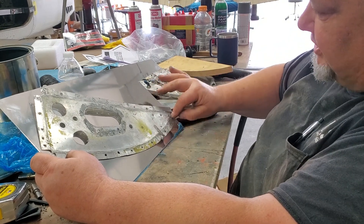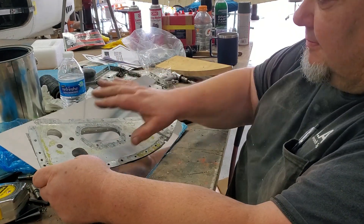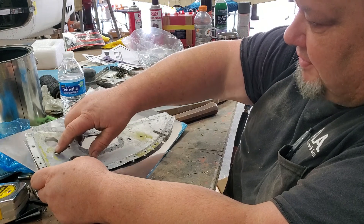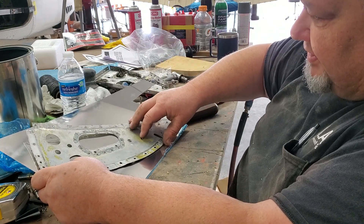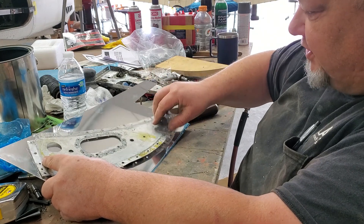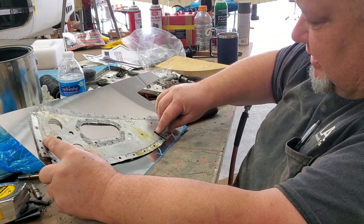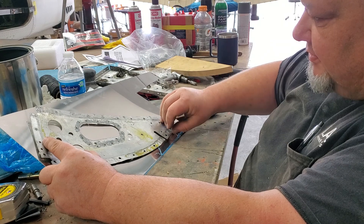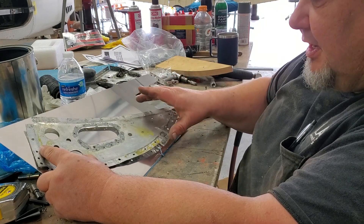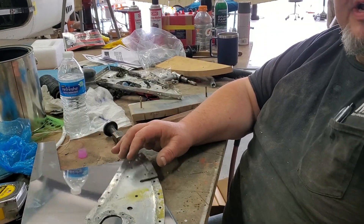This one's going to be almost 45 degrees here, 45 here, maybe 10 degrees here, and then up to about 45 — so 45 to 30 to 20 to 10. We'll get a little action in the straight area right here, which hopefully won't make too much of a difference. What we'll do is draw around the perimeter, draw in the holes, find their centers, draw the little holes as a visual reference, cut everything out, deburr everything really nice and smooth, and cut out the little relief for the angle that goes through there. Once that's all done I'll clean it up, make sure it's completely deburred and super smooth, then we'll put it in the form block and bust it over.